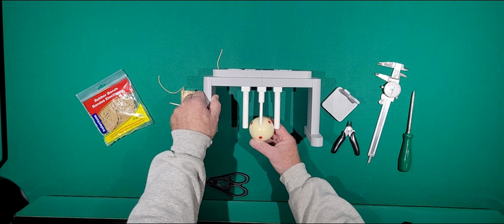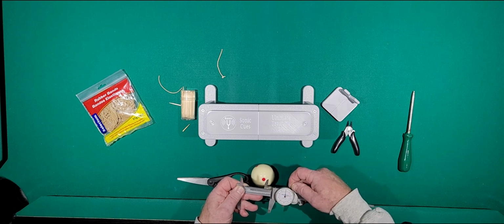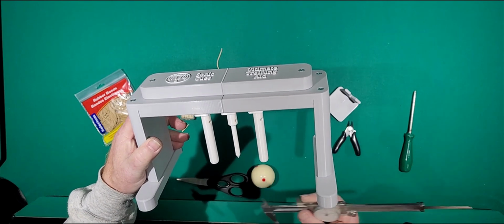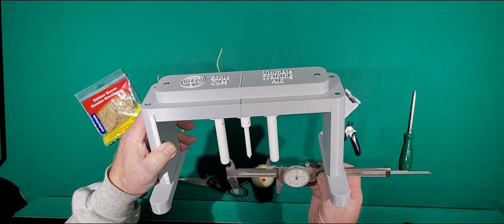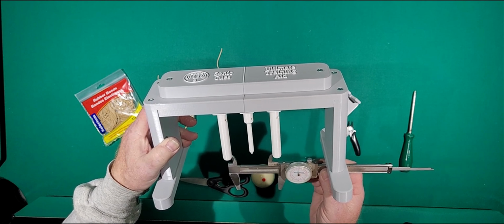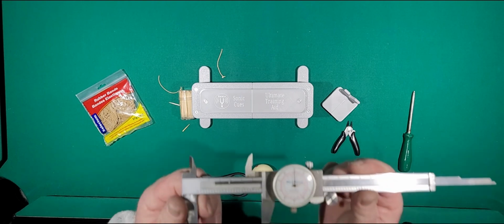Very tight tolerance. If I take this tool and I set it up at 2.300, pick this up, using the bottom of this foot to help me hold it still. That is a seriously accurate gap right there. You didn't even see the rods move to put that in there, and there's no space on outside of the rods to the rods. I mean, it's exactly 2.3.